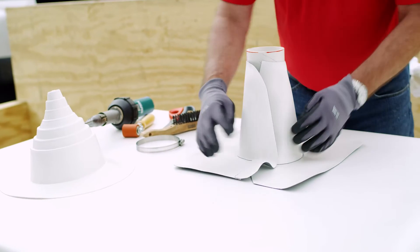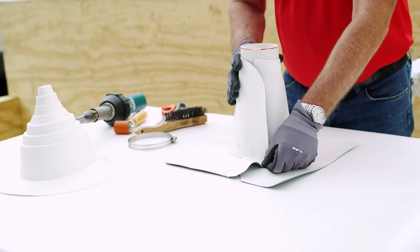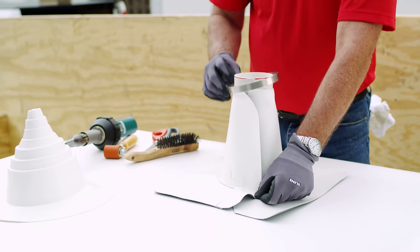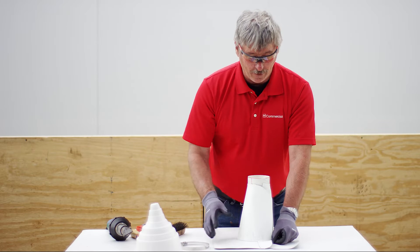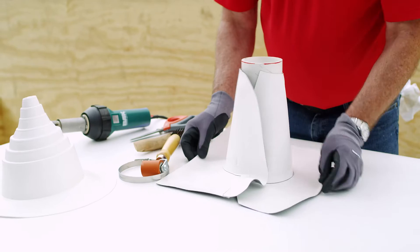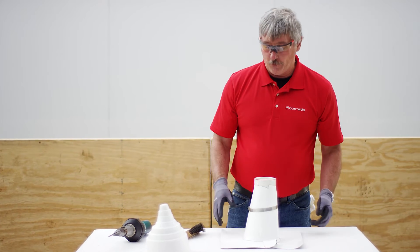So a little trick is: get it where you want it. You don't want to wrap it over — you want it snug but not over tight. Kind of get it centered. This clamp that comes with the accessory, just slip it over the top of it. Because you need two hands to weld — if I've got it nice and tight and then go to grab my gun and my roller, it's going to come loose. So get it where you want it, take this clamp, slip it over — it'll hold the shape and now I've got two hands free.